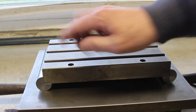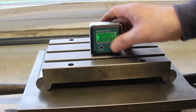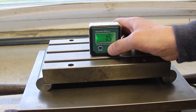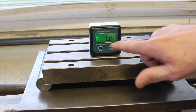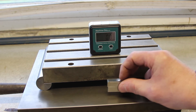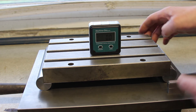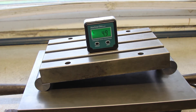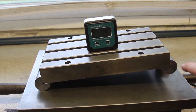Here's a demonstration. The distance from this pivot point to this pivot point on this plate is 231 millimetres. There's a calculator on the Little Machine Shop dot com website - I will put a link in the description. So here's my little angle gauge, not brilliantly accurate but good enough. The plate is set to zero. According to the Little Machine Shop calculator, I need a stack of 20.1 and change millimetres. There are some gauge blocks at 20.1 - if I put that under here, there you go. Let that settle - 4.9 degrees.